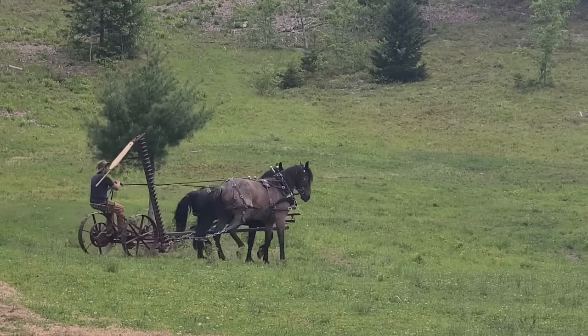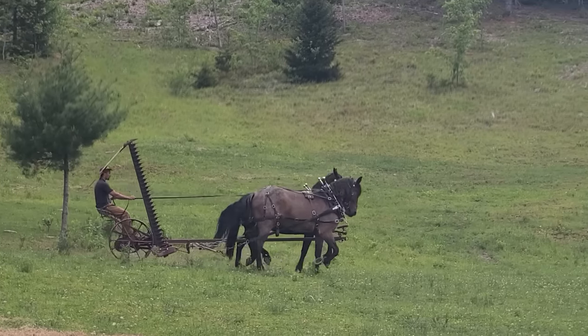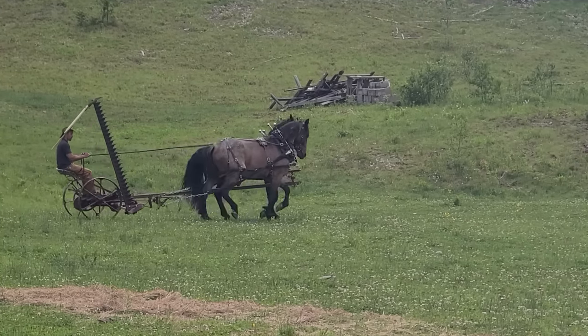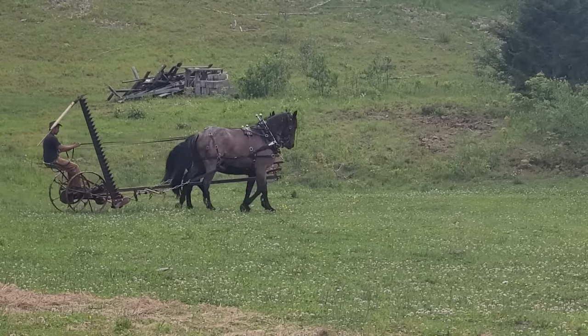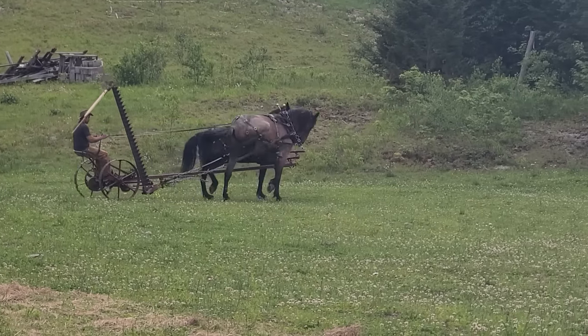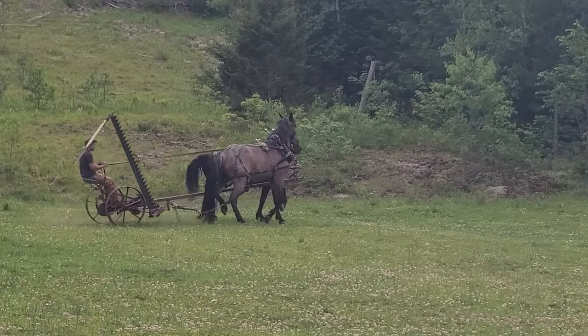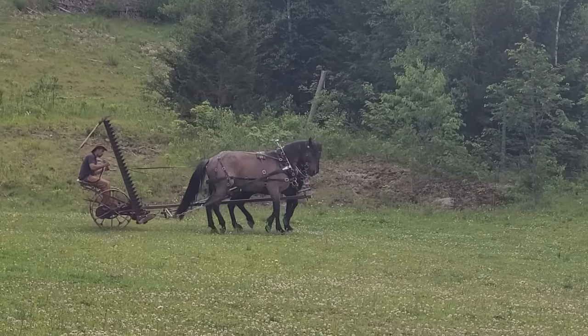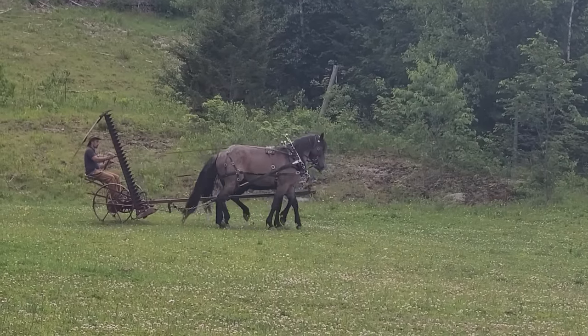And it's about here that I noticed that the majority of their stress is because the sickle bar is adjusted in such a way that it's clanking against the treads of the tires. When I took everything apart and put it back together, there's a lot of balancing and adjustments that needed to take place to get everything rolling smoothly and as it should.